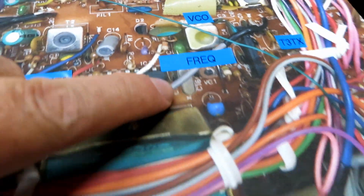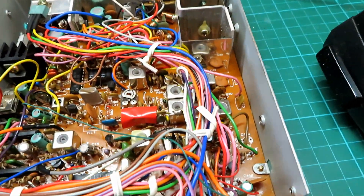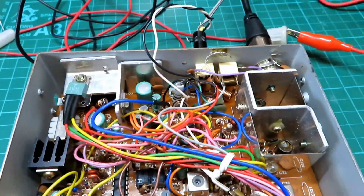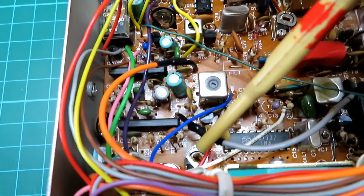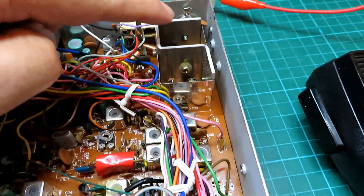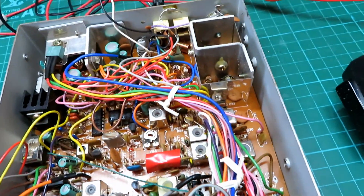VC1 is down there to adjust your frequency — I've added that to the diagram. The relay is good, unlike the last two LCL communicators I've done where that was a problem. You can adjust the TX power with this adjuster on transmit, which is quite a useful feature you also see on much later radios. You can tune for optimal TX output and then adjust that for maximum power, which is quite nice.